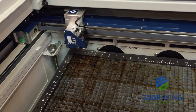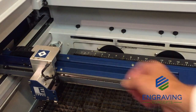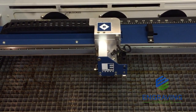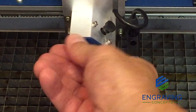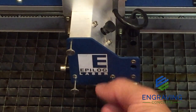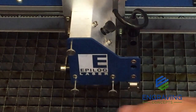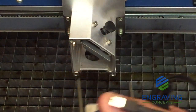With the machine powered off, we can simply reach out and move the lens carriage manually. We grab the lens carriage and move it out so it is easier to access the lens area. Now that we have easy access, we are going to remove the lens assembly from the x-axis carriage by loosening the three silver captive screws on the front side. This unit has the eView camera module — that is the black cable just above the lens area — so make sure the machine is powered off before you unplug it. Once that is loose, we can pull that straight forward for easy access for cleaning.